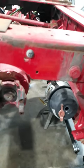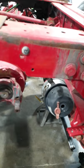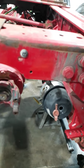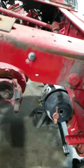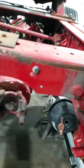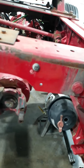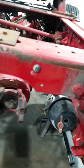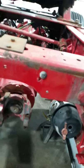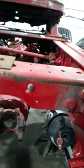We think about frames as being really rigid and solid, but they flex a lot. If you've ever watched a truck pull away from a stoplight, especially when loaded, the whole truck twists with all the torque to get that weight rolling. They're designed to give and then return to normal — not completely rigid, because that would break things. They're designed to have some flex to absorb torque and torsion and then return to normal at rest.